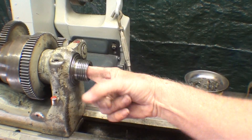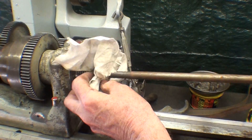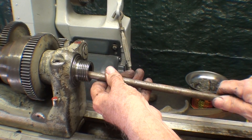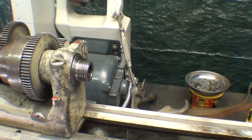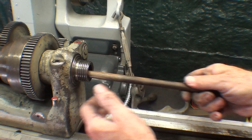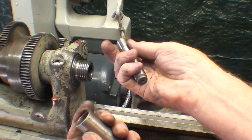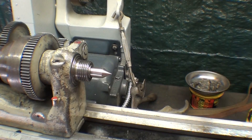What I'm showing you now should be done on a regular basis: I'm going to clean the headstock spindle out and push a clean rag all the way through, and let it drop out the other end. Make sure that's clean. And now I'm going to put the sleeve and the center in there — they've been wiped clean and lightly oiled.